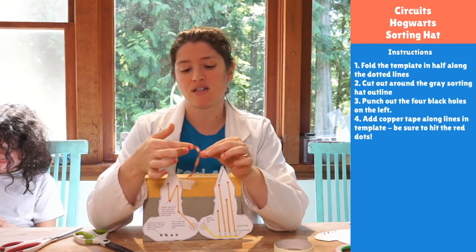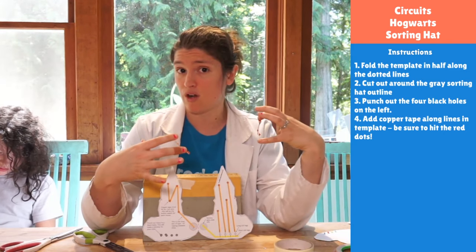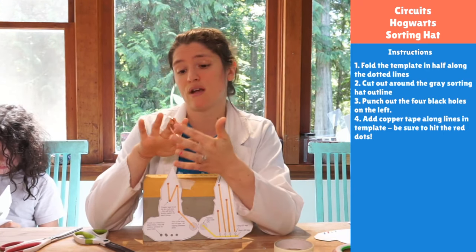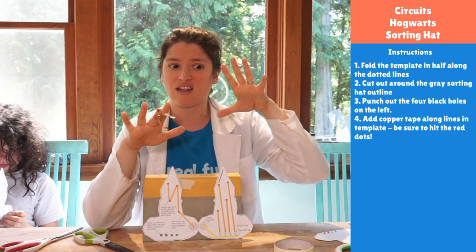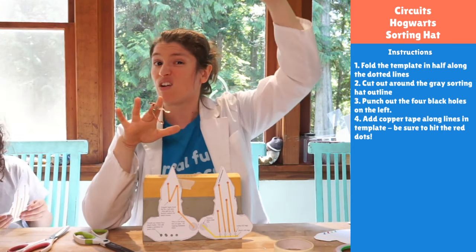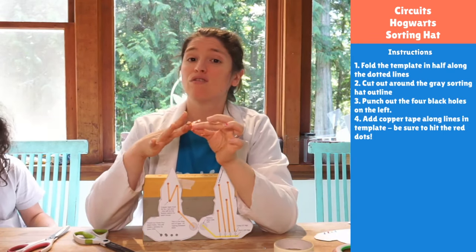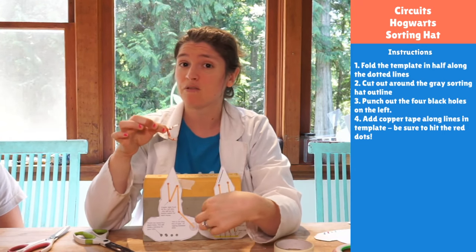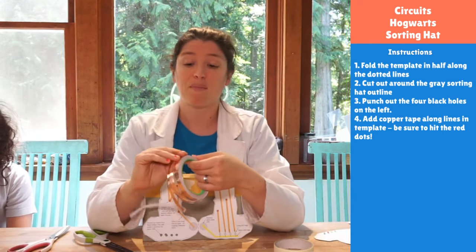And we don't want to rip our tape, because once we rip the tape, we've basically made a big hole in our road, in our highway that those electrons go on. And even if I tape on top of it to continue my road in a different direction, the electrons will be on this great road, and then they'll see the end of the road, and they look up and see another road up there, but there's no way really for them to get all the way up there. There's all this gunk and goo and glue that they have to go through. And that can really break your circuit. So one of the things is we always stick it down as we peel. And when we get to things that turn, we always try to turn the corners by folding it.